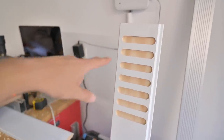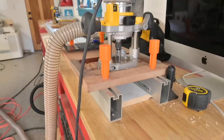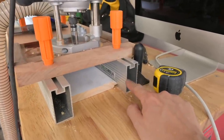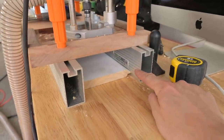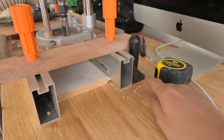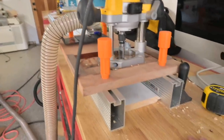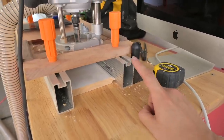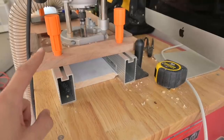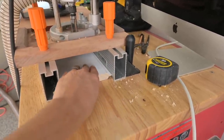So check it out — this is my little fluting jig. The flutes on the sample were done with a mortising bit, not a bowl cutting bit like I want to use, so I'm going to get a bowl cutting bit and it'll look a lot better. It's a really basic build — I built this with track tubes and just a couple scrap pieces of wood. I've got this track tube here which is semi-permanent as my miter saw fence. Glenn over at Track Tubes — actually the inventor of track tubes — had this idea to have a knob with a threaded insert into the table and a little 3D-printed bracket, so you can move and dial in your miter saw fence. Two knobs like that are holding this jig in place — and these two track tubes are connected via this piece of mahogany.